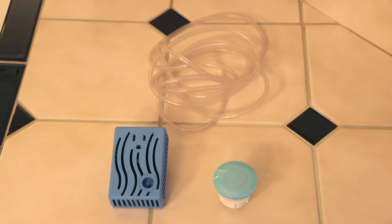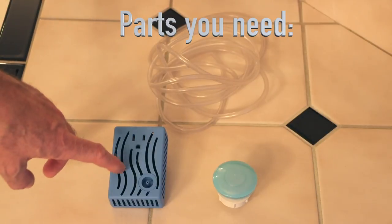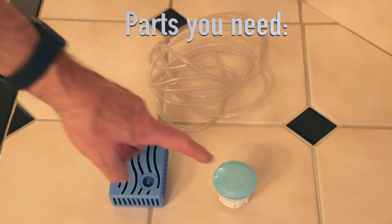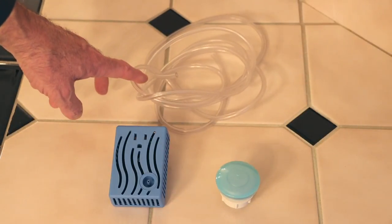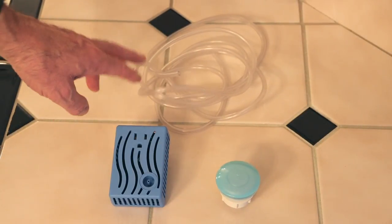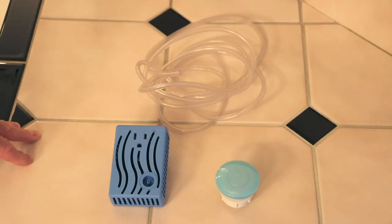For today's video I'm going to show you how to change the location of the on-off button for a jacuzzi tub. In the description I'll have a link where I ordered my new parts. This part here is the control box, my new on-off switch, and this is tubing that goes from the switch to the control box for pneumatic tubing. It just pushes the air through and I'll describe that later when I put it in.